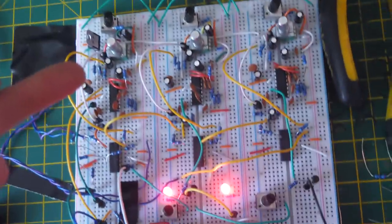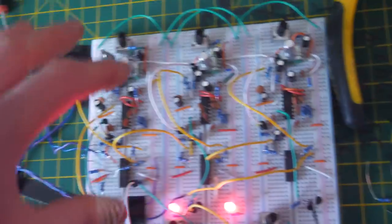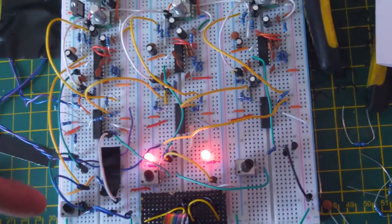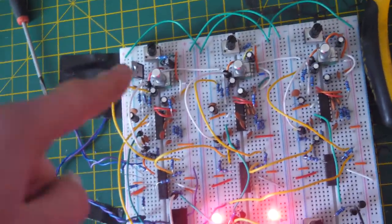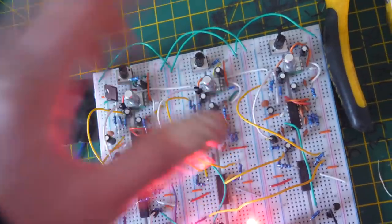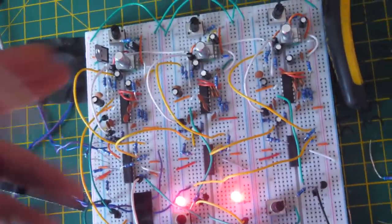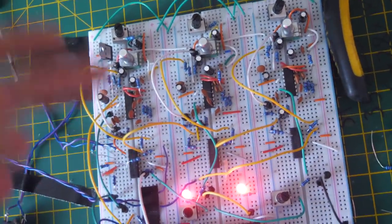It's going to have control voltage in to the overall thing, and all three of them are connected together. This is a master delay time knob, and these two knobs are offsets of that. So when you're adjusting the time of this first one, it adjusts these two as well, but offset from this. So when you're twisting it, all of them go out of time with each other, which makes it overall a bit fatter. It's got wet and dry for all of them, so if you really want to go down to one delay, then you can.